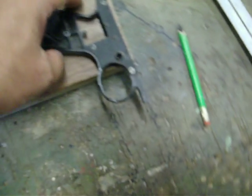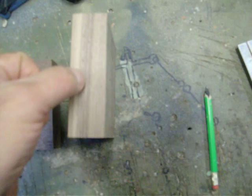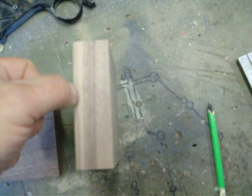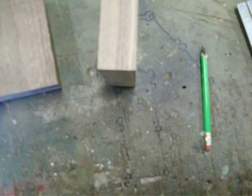At that point you have something to work with. With the grip screwed in place on the big wood block, I trace around it — and I know that's what I'm going to be cutting out on the bandsaw. But before I cut that out, I turn it on edge and I trace my profile. For a right-handed grip it would be a thumb ledge on this side; for a left-handed grip, on this side. I make my shapes, get them all lined up, then run it through the saw on the bandsaw and cut out all that material. I lay it the other way and cut out all the material I can that way.